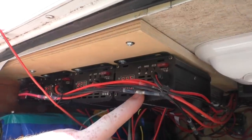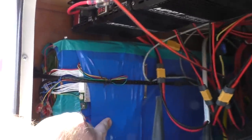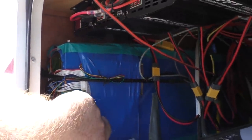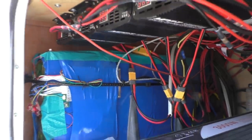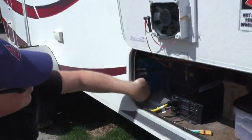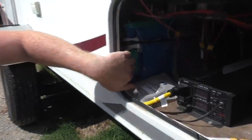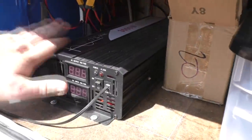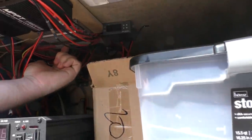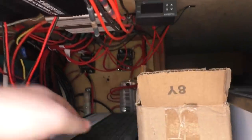So they're bringing the amperage down and the voltage up? Yeah, because this is a 48-volt pack, and it's made out of these old Lime e-bike cells. They basically sold them to Lime. It's made from about 9 or 10 of those — I took them all apart. It's about 318 18650s, about 3.5 kilowatts. I have a 3-kilowatt inverter — that runs everything. And then I have a 12-volt buck converter that bucks it down from 48 to 12 for 12-volt loads, and my fuses and breakers are back there.